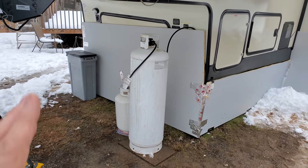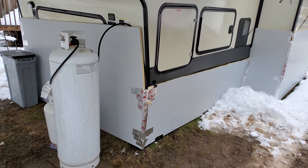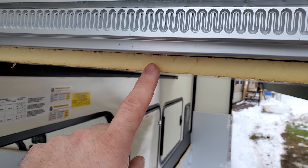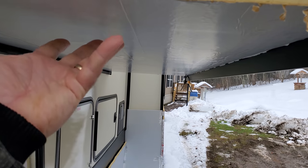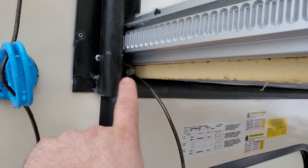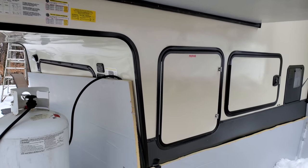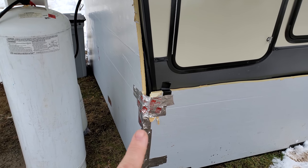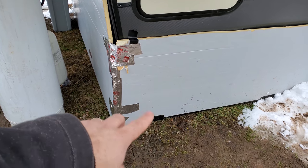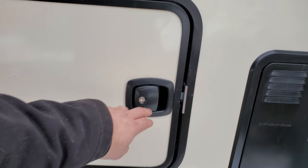With the hundred-pound tank, we don't have to fill it often. When it gets down to seven below, the 30-pound tank only lasts two days. Under the slide-outs we also put poly iso insulation because you get cold air radiating through the floor — this eliminates some of that. In all the slide-out corners, any spot where air could get in, we stuffed insulation. We used cold weather silver tape to hold it all together, and landscaping spikes at the ground to keep it from kicking under.